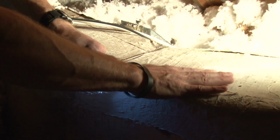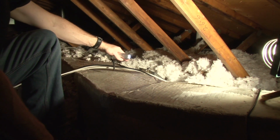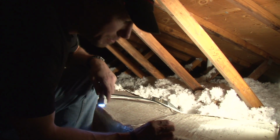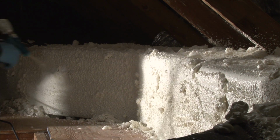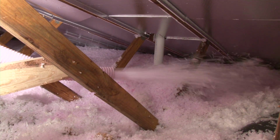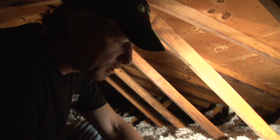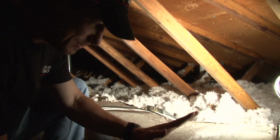So sealing the ducts, sealing all the connections to the drywall ceiling and from duct to duct and so forth, and adding insulation, because the little bit of insulation here is just not enough. We need to add insulation to ducts in these very hot attics to prevent heat gain in the summertime and heat loss in the wintertime. Make big improvements, because this is a terrible, terrible problem. Ducts in attics, bad problem.